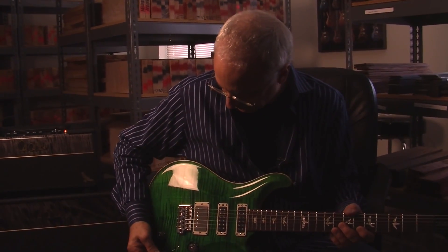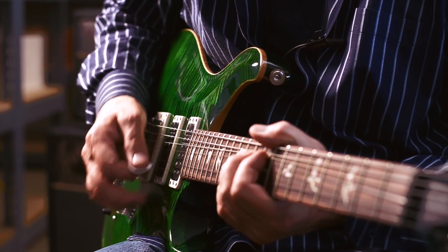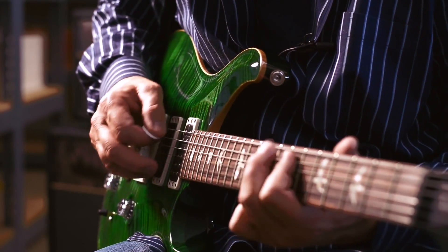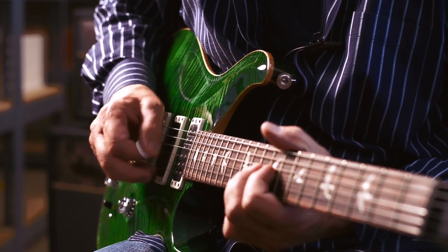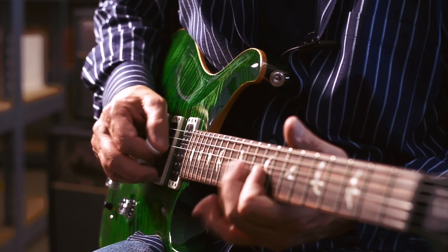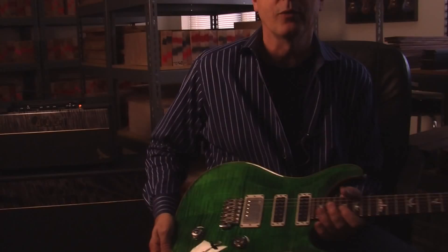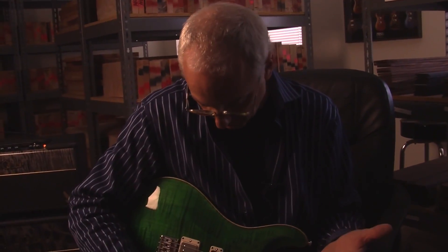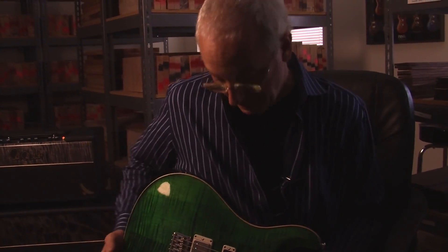The other thing you can do is you can put this one and this one on at the same time — normal on a 5-way switch — or the two narrow fields on at the same time, this one and this one. If you're looking to split the difference between a single-coil bass and middle tone and a humbucking, we think this does it perfectly, and it doesn't hum.